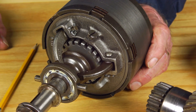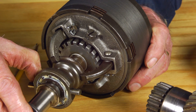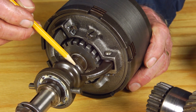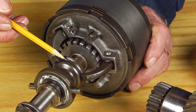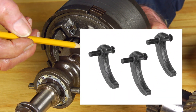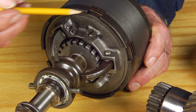Let's take a closer look at the forward latching process. When the shifting lever in the cockpit is moved into forward, connecting linkage pulls the operating cone aft, and its conical shape spreads the trailing ends of three latching fingers until the ends drop into the groove which runs circumferentially around this end of the operating cone. The front of these fingers, being somewhat L-shaped, wrap around the front face of the adjusting collar, which wedges the clutch disks together to give us forward.